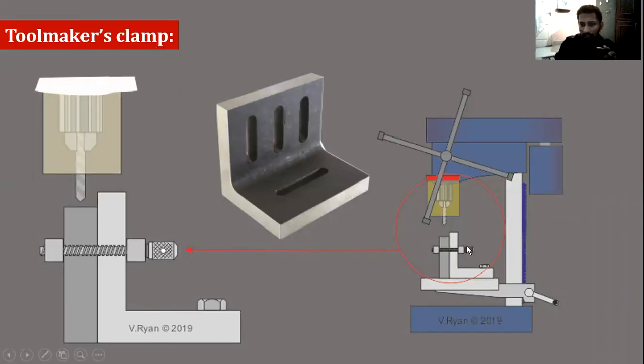If you were to use a C-clamp horizontally it would come down and not fix properly, so in that case you go for a toolmaker's clamp. Nowadays, machines have their own built-in machine clamps — called machine vises. For separate machines there are separate machine vises. For heavy-duty operations with a heavy-duty drill bit rotating at high speed, you need a clamp that holds very tightly.